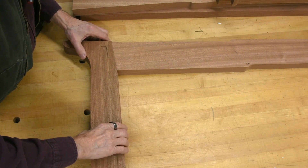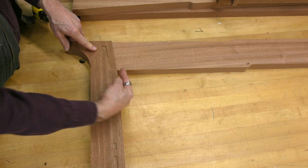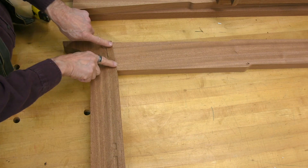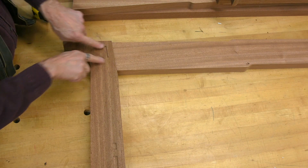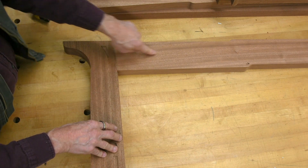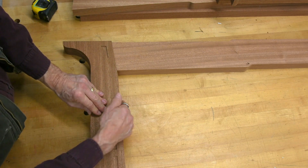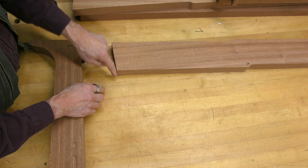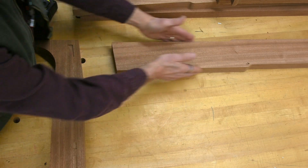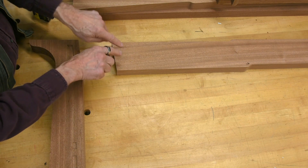This is how that rail lines up to the leg. You can see there's a straight line here, but then it starts curving right here. I want to put a floating tenon, a mortise, right here that's 90 degrees to this surface here. It also has to be 90 degrees here to this surface — the mortise. Here it's easy because I can register against this. Over here, I've got an angle, and this is angled right here as well. There is no common parallel or 90-degree surface to register from.